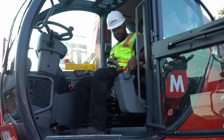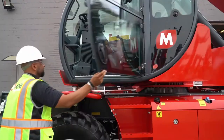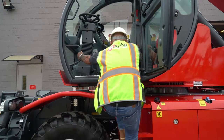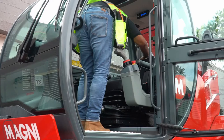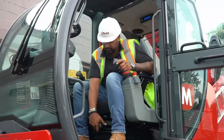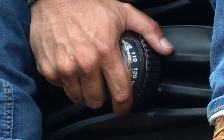The innovative design of Magni's cab ensures unbeatable operator comfort and safety. When opening the door, push in the door while pulling the handle to relieve any pressure built up in the cabin and allow proper function of the latch. While climbing into the cabin, maintain three points of contact at all times. Magni cabins provide safety steps and grab bars to allow you to do this. All Magni's come with a fully adjustable seat to fit most any operator. The seat has six individual adjustments. First, adjust the suspension by turning the regulator to your approximate weight — clockwise to increase and counterclockwise to decrease.